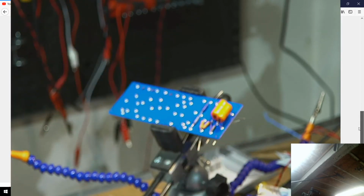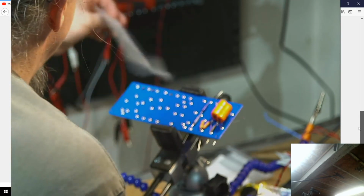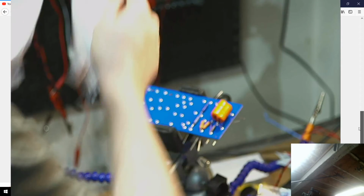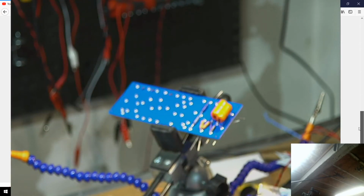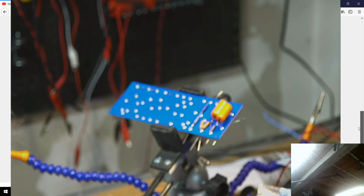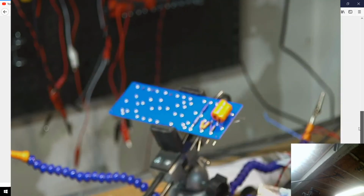And now I just need a couple of 1.5K resistors. Those are in here. My 1.5K. I don't remember if I grabbed those out. I don't think I did. Or did I? Maybe I did. Oh yes, I think I did, because I wanted these to be Dale as well. Is this them? Yes. So these are some Dale resistors as well. There's two here. Since I've got the 1.5K out, I will put all four in. These go to each of the cathodes, 1.5K. Oops, dropped one. They're all 1.5K on the cathodes of all of the tubes.